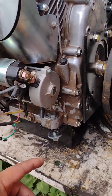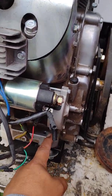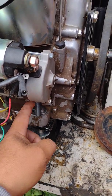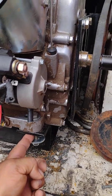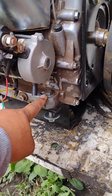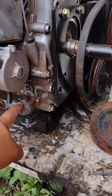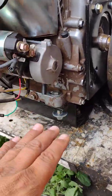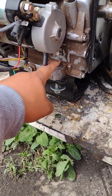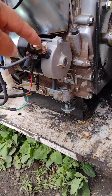Keep this in mind: with that template I didn't have to figure out where the holes were going to go. On the right side of the skid steer when you put the engine in, there's the original hole for the engine and the original hole for the motor mount. You stick your bolt through and this tells you where the rest of your bolts are going to be. I used the cardboard, made a template, traced around the engine, put the engine on the cardboard, traced around it and marked the holes. Took the cardboard, put it on the motor mount plate, dropped a bolt through it so it doesn't move, got a marker and marked the holes.